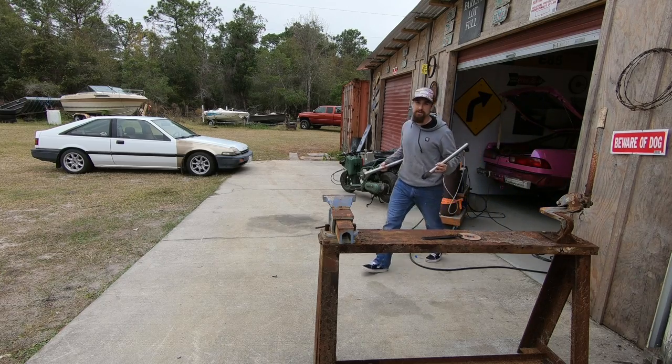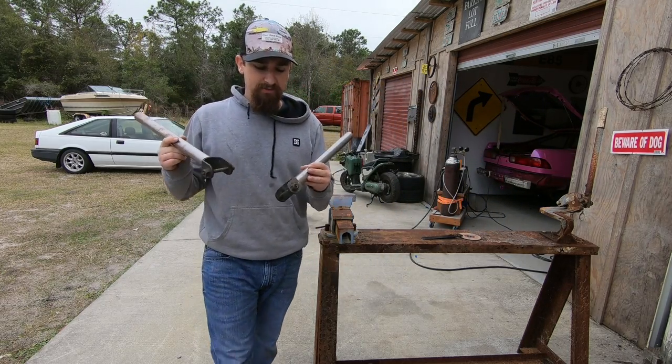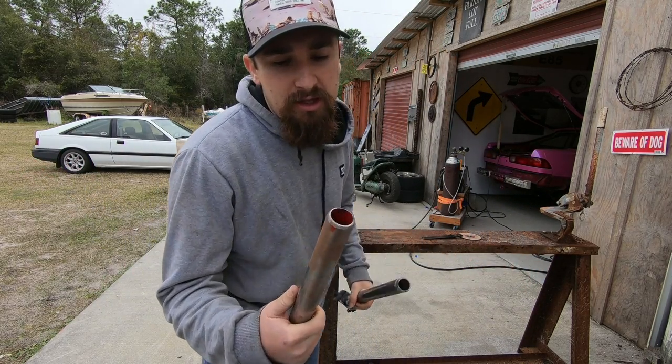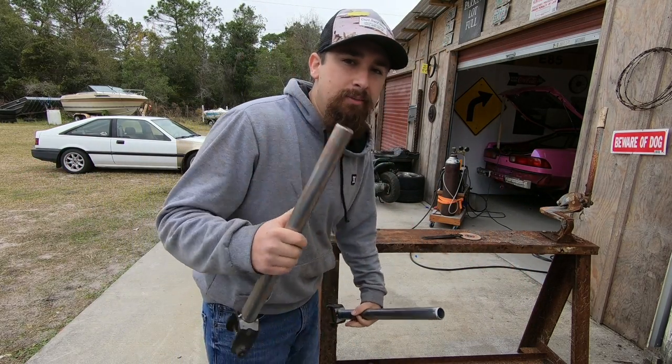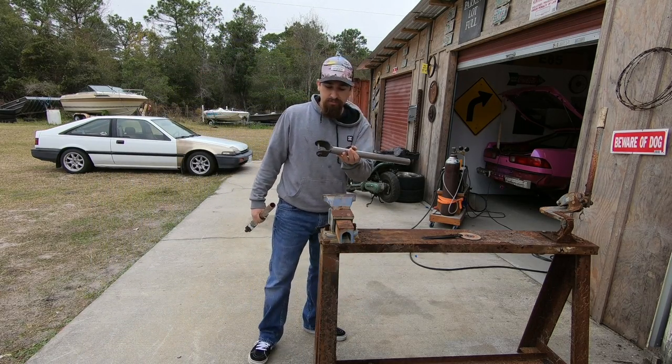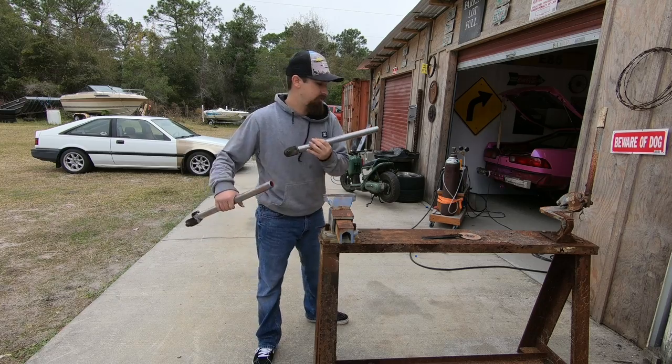And also, I was thinking with these vertical rods that I can finalize the welding at the bottom, because if I need to trim them, I'll trim them from the top, even though I have to bevel the top again. But that's all right. I'm not going to disconnect this. It'll be a lot less work for me to just weld them together and finalize the bottoms.